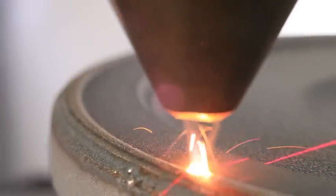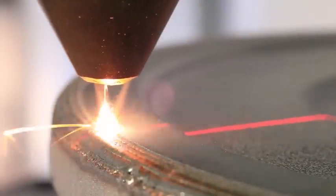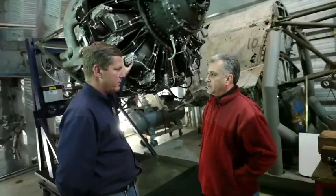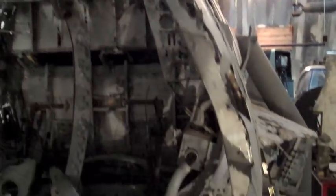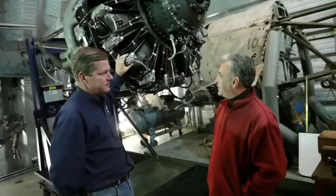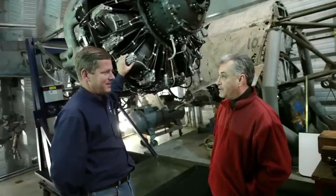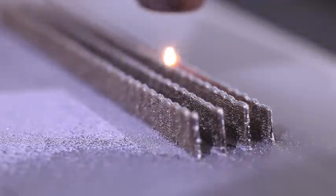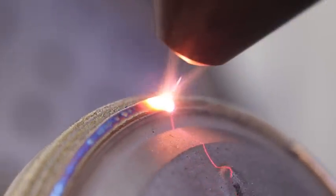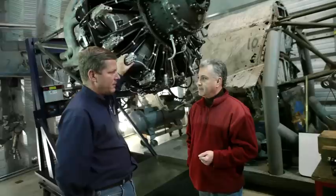We're going to employ laser technology. We're going to provide metallic powders which will be distributed into the laser beam. Through CAD models, we can go back and restore worn areas and help restore the components to the original. Being able to bring all those different disciplines together — using SolidWorks has enabled us to create the files, and also with BoltWorks doing the reverse engineering and the scanning, we can provide the data of what the part is supposed to look like and the damaged part, and then we'll test it in our engines.